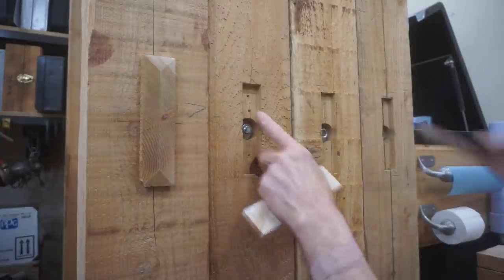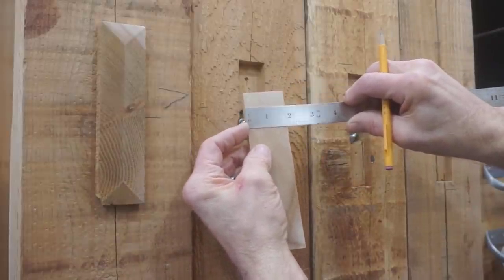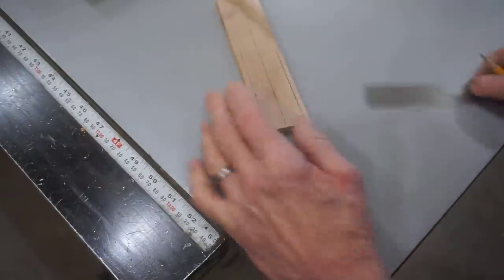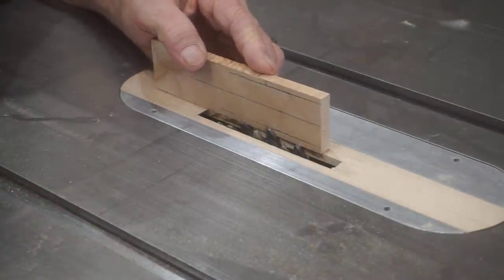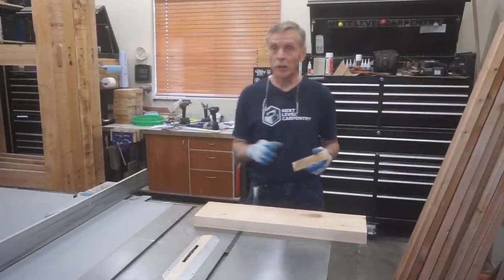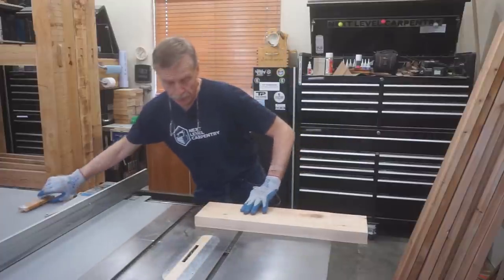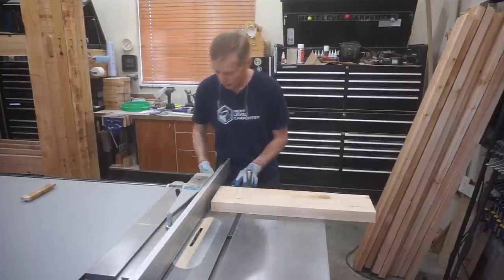To set the height of the dado blade I measure the width of the mortise where the cap is going to go, which in this case is one and five sixteenths of an inch, and then carefully lay that out in the thickness of the piece — which is an inch and three quarters. With an inch and five sixteenths centered up on the thickness, I can set the dado blade to the height of either of the two side marks. It's the dado blade height setting that determines how loose or how tight these caps will fit in their mortises. This dado blade setup is about half the magic to getting good consistent accurate results on these pyramid caps, so take your time and dial that in. Once happy with the setup I'll set the rip fence to a quarter of an inch, and that'll make sense shortly.